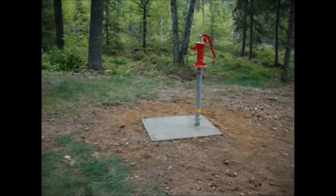Okay everyone, there it is — everything's done. I'm not going to pump on that well now for a couple days. I'm going to let it set all of tomorrow and let that really cure good. The concrete is still not completely hard if you run your hands over it. It's supposed to rain tonight, so I'm going to tarp over the top of that and let it dry nice and slow. That part's done. Before I leave up here, I'm going to be taking a sample of the water and next week we're going to test it.